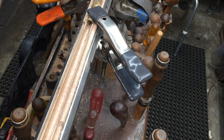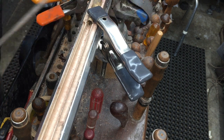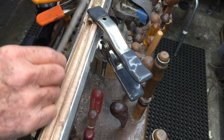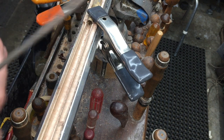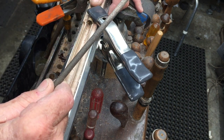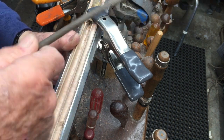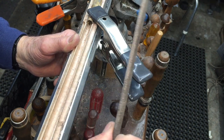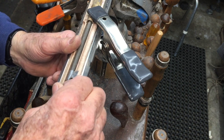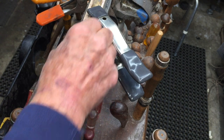All right, I've snapped the lower thimble back in just to make sure that our loading stick will still go in, go to the bottom here. Sometimes the epoxy fills the hole. Actually, it's a good idea to, once you set it in the epoxy, wait the 20 minutes and take the screw out, what we should have done at that point is use one of these round rasps in the hole, and if there's any epoxy there when it's in that rubbery state, this pushes right through and it will go in there.